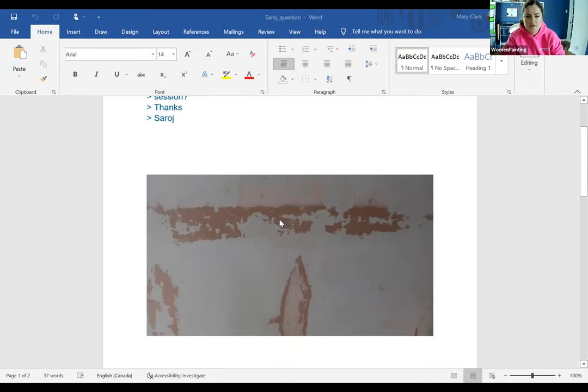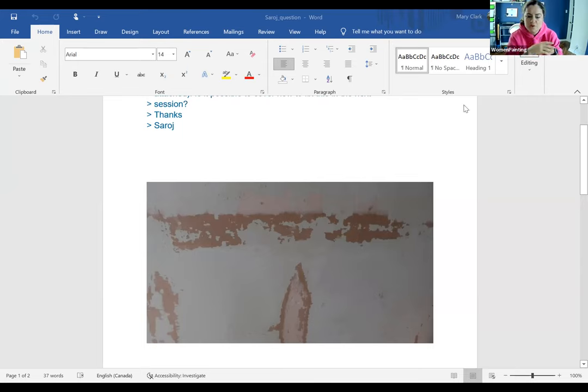So we do this a lot. We just did one — a master bedroom where we had to remove all the wallpaper from the ceiling, the walls, everywhere. A lot of times the wetness of wetting down the paper will cause the drywall — like the actual paint — to peel off the wall a little bit. Some areas have glue because of however it was installed. Sometimes there's glue, sometimes there's paste. And that sometimes comes out with the paper when you're removing wallpaper. In this situation it's a thin layer, it's not that bad. We've seen situations where it's a lot worse, where there's like a lot of chunks of glue on it. And all you really do is use that five-in-one tool — the scraper — to scrape off the excess glue. You have to remove all the big stuff with the scraper.